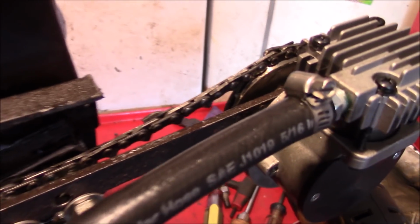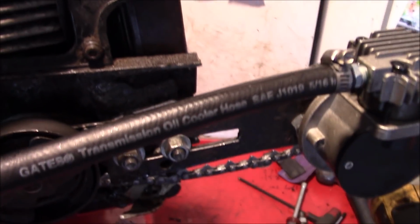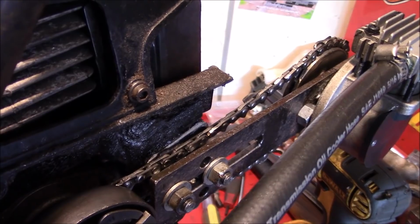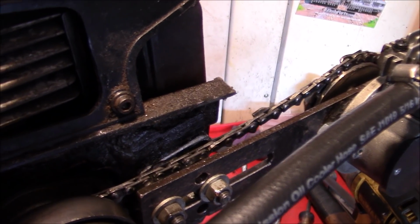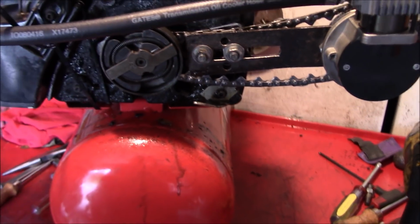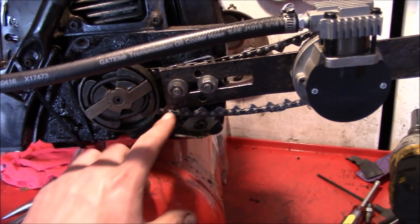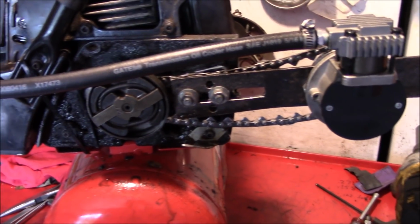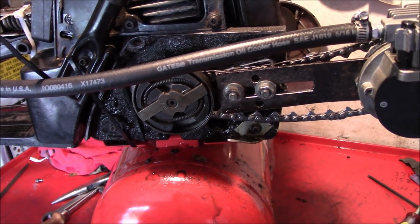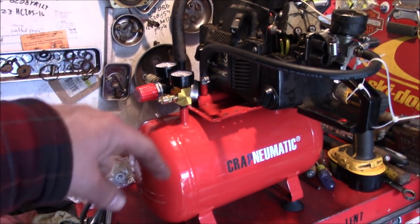One problem that I do see from the amount of metal shavings on the chain, that sprocket is definitely the softest of all the steel pieces, and it's going to wear out first. So we're going to have to get back in there and either weld up them teeth to give it a hard face, or beef up that sprocket. Honestly, if you're going to do this, you should probably just get a junk bicycle and go to a roller chain. This was a lot of hassle trying to reuse this as a drive chain, so don't do it. Maybe I can change your mind. But it works, as long as you keep your standards low and your spirits high.